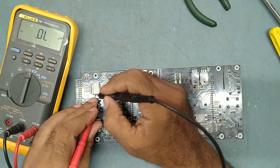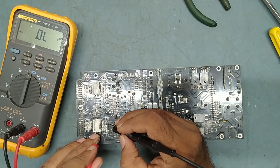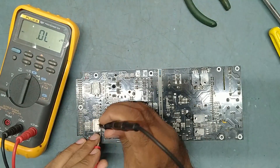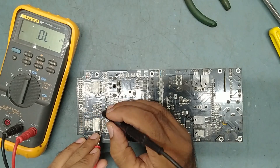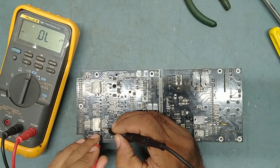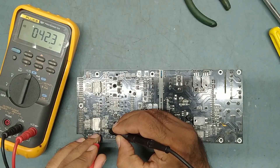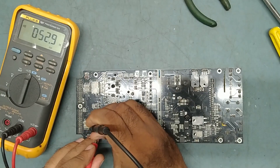Pin number 3 is showing some shorting. As I said, pin number 3 is positive analog supply and pin number 23 is also positive analog supply. Here, pin number 23 is shorted — showing some shorting in the IC. Pin number 3 is also showing some shorting. So this IC is confirmed defective — it is showing shorting with the negative supply. Pin 24 is negative and pin 23 positive — it's showing 42 ohms. It should not show that. Pin number 3 is showing 54 ohms — it is fluctuating.